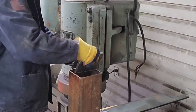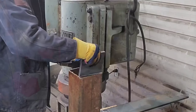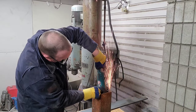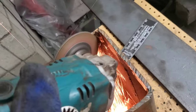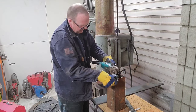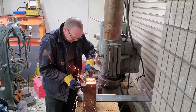I'm not going to lie — I kind of lucked out here. I meant to cut it a little bit oversize and then grind it down to size, but it turned out it was perfect. Now I'm just going to jump in there and grind out the inside — I want to get metal to metal so I get the best possible weld. Then I'm going to go back later and weld the living bejesus out of it. But before I do that I better get those corners round so it fits in there just right.